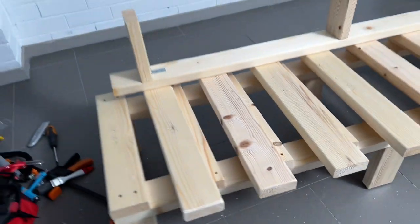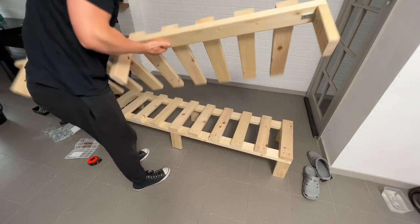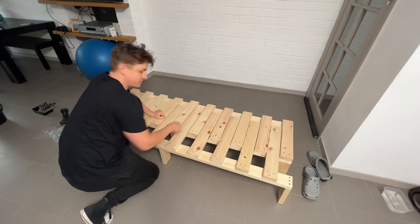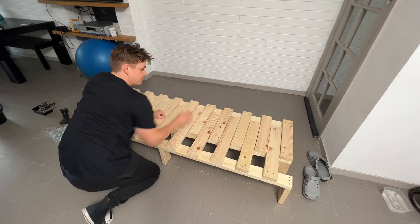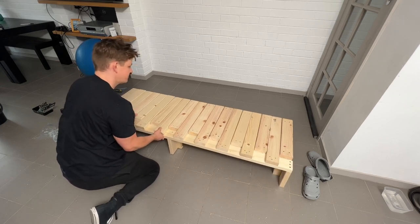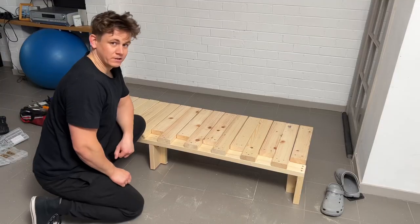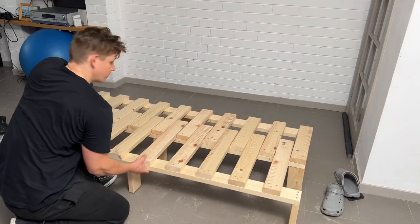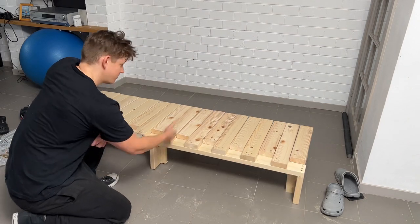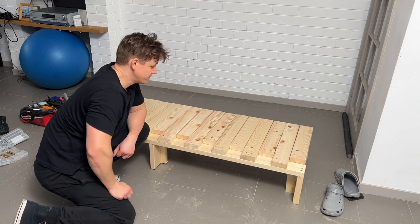So when they slot over they will go a bit smoother. What I mean about sliding over is like this — when it's at this point where it needs to go over that last bit of timber there, if it's sanded down it's a bit smoother. Now let's do a little one-handed test — all the way out, all the way in. That's way smoother; there's absolutely no catch at the back end here because I've sanded that all down.